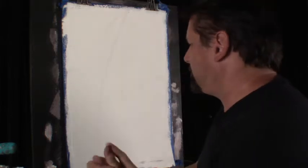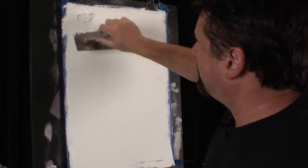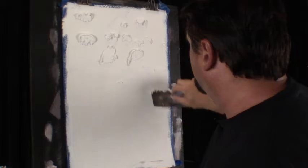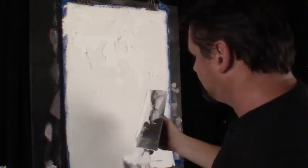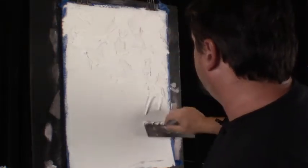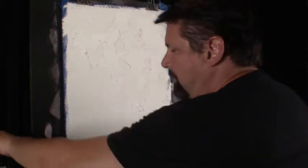We're dry, hands aren't clean, but we're dry. So now, next application. Taking our trowel, we're just going to put some plaster on like so with the Faux stone. I'm going to tap the surface like so, kind of glob it on. Not a very technical word, but that's what it is. And then I'm going to come back and start to knock some of this down. Some people refer to it as a skip trowel. I don't have a fancy name for it. Just trying to make that nice old world plaster look, or an old textured look on an old wall.